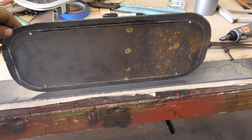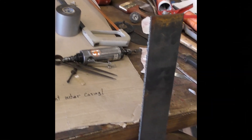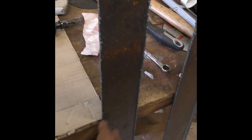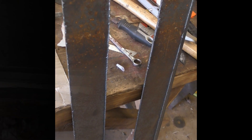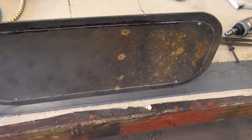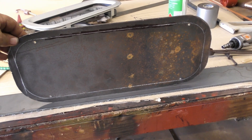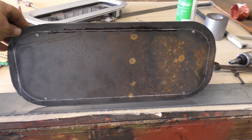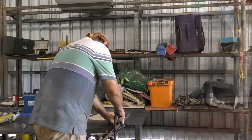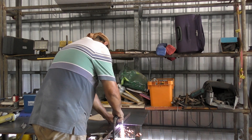What I did initially to create the outer framework of the box frames was cut strips of steel from plate. Then to create the inner frame — or the inner bead for the port light to sit against — I cut those rings out of flat bits of steel using a plasma cutter. You can see I'd already marked out the shape and drilled some pilot holes to start the cut, and from that point I put them on the bench and cut the rings out.